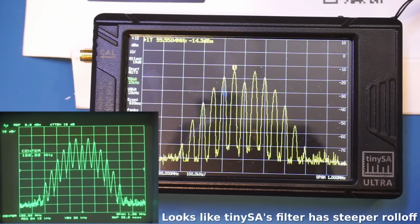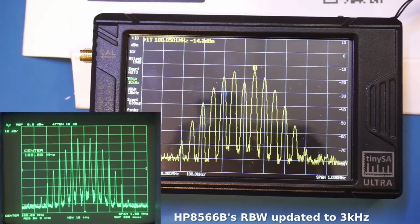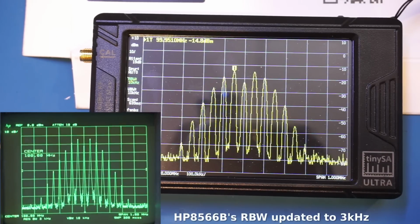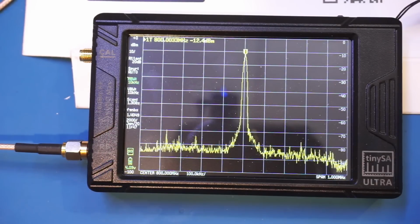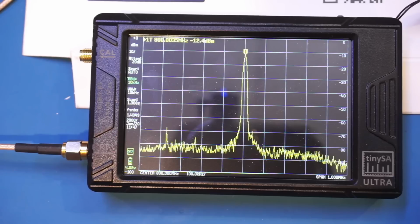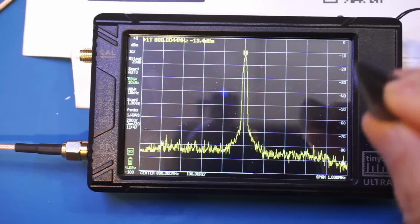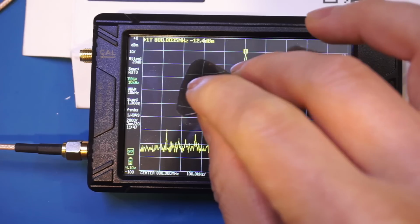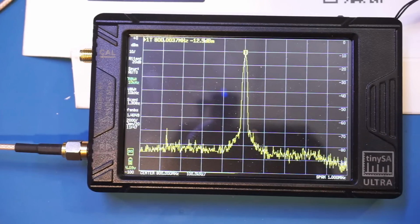And here you're looking at a frequency modulated signal on top of that 100 MHz carrier frequency. The signal that's being modulated is a 50 kHz signal, and the frequency deviation currently is at 100 kHz. Right now we're putting in an 800 MHz frequency, and that is at minus 10 dBm as well. As you can see here, we are able to capture that signal at minus 13 dBm, which is typical as we do have some cable loss here.